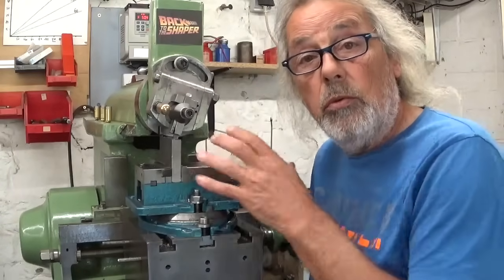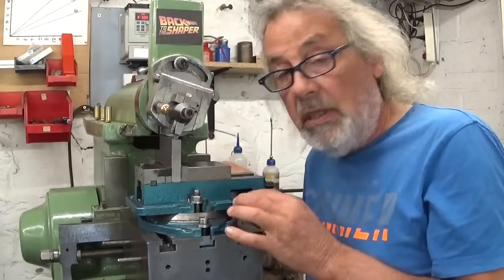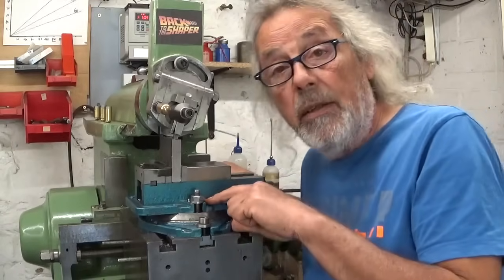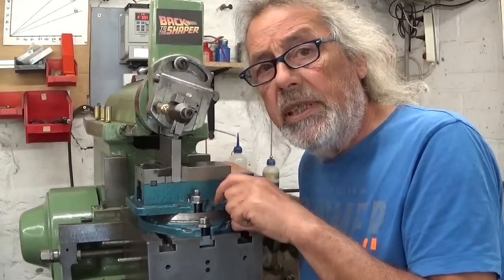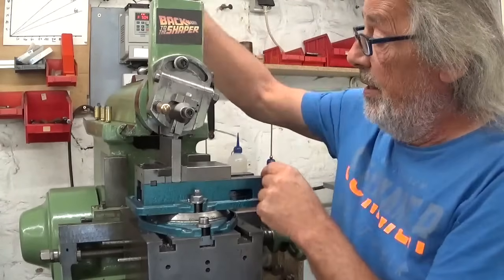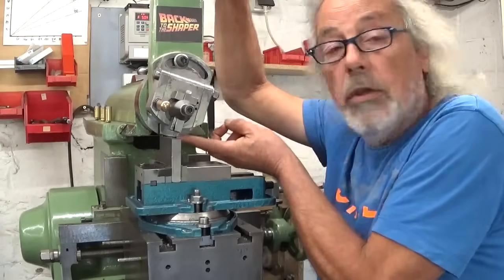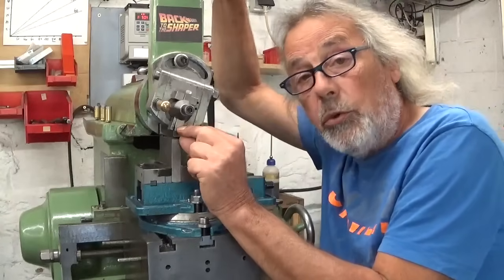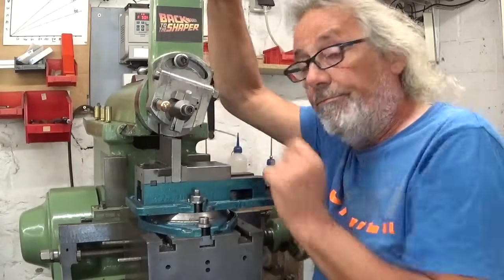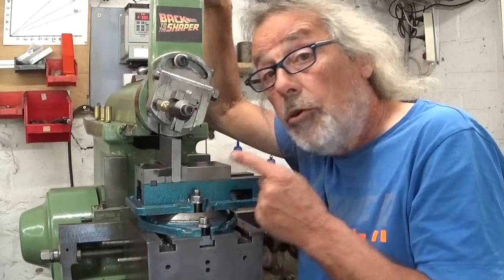Because I need to turn my vise, I installed the swivel base. That of course is made for it, but I lose here almost, I think, 40 millimeters in height, which means my top slide is very high, and here at the bottom you can see the dovetail. My cutting tool is really short here. But it's still touching. Let's find another setup.